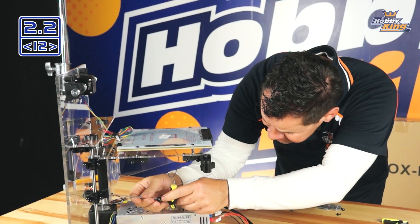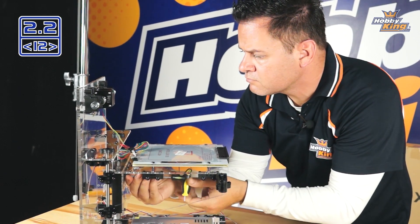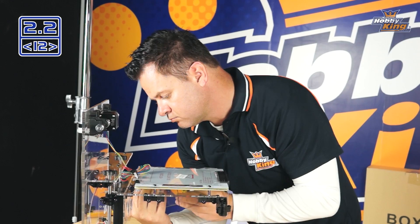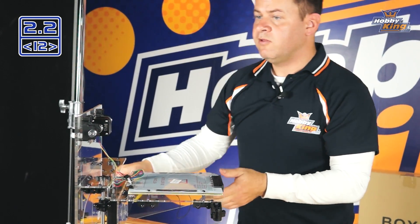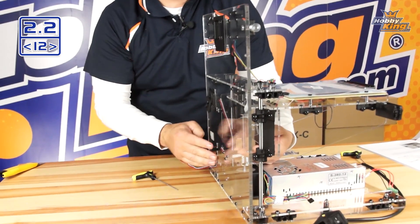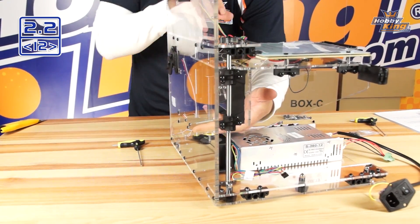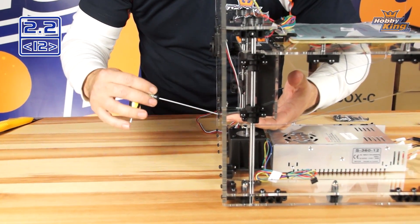Followed up by these screws right here on the inside. Now the final step — we need to do a little bit of what we did before, which is pre-loading this Z-axis shaft. Since we loosened and tightened this up, it allowed the shaft to align with the motor, being able to slide back and forth slightly, so we need to get that pre-load back on there. I'm going to make sure these are good and loose — you can actually hear the play in this machine as I lift up on it. I'm going to lift up on the machine almost holding it up and tighten up these back ones right here.